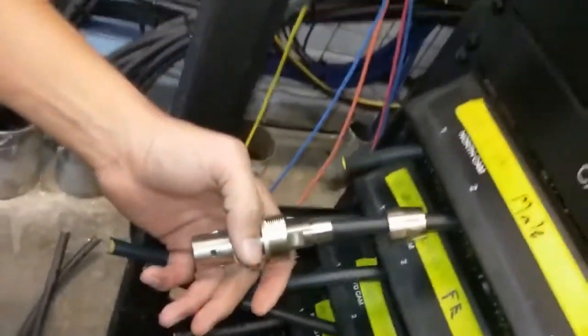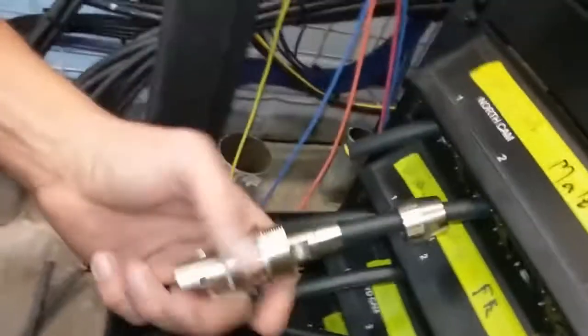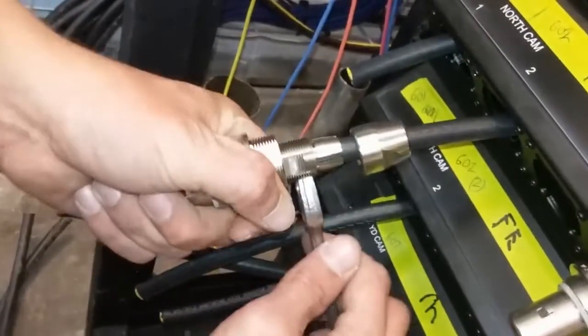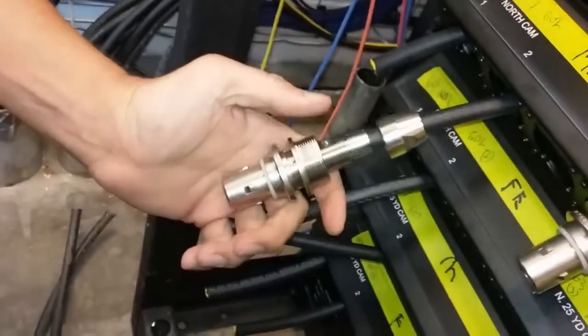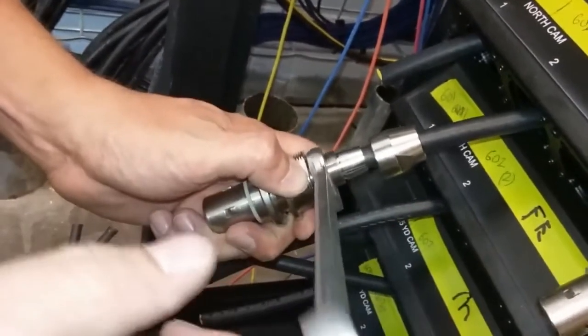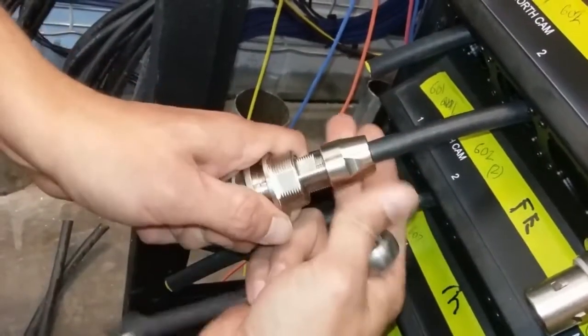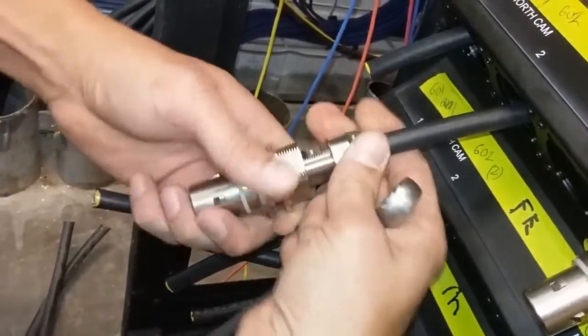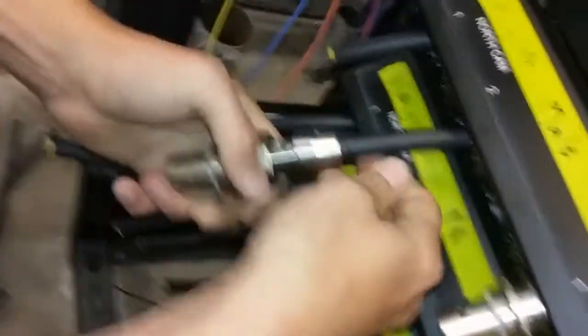Now, it says that you have to have a couple different wrench sizes to tighten up on this, but I always hold this by hand so as not to over-tighten it. It's really not very much force at all. 70 inch-pounds right here, which is the 5.83 foot-pounds of torque that we were talking about. At which point this goes on last. This is what actually cinches down on the jacket of the wire.